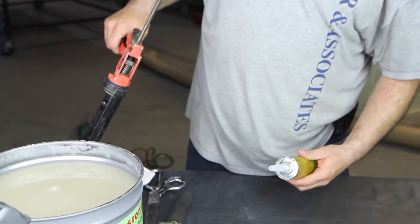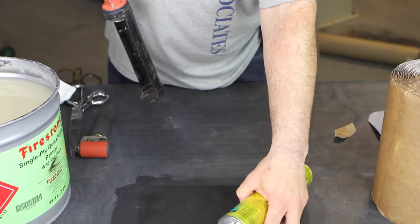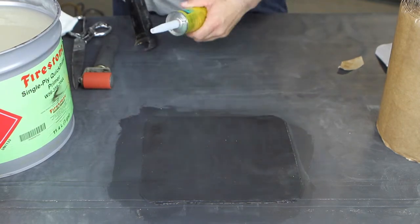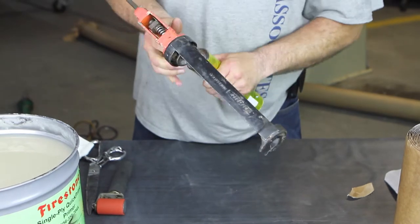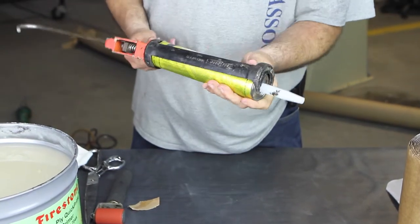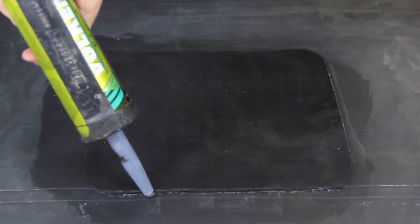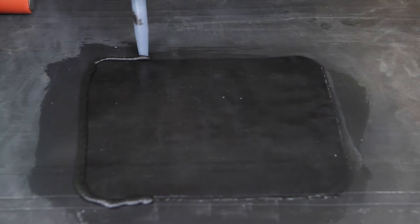After the patch is installed, you want to install sealant on the cut edges. You can see the factory edge of the tape has got a little bit of what we'd call bleed out. But where we've cut the edges, now to keep them from wanting to roll up or peel up, we install sealant. Manufacturers have their own sealants for this. John's using a urethane sealant. He'll go a little past, an inch or two past where he's cut, and he'll install sealant.